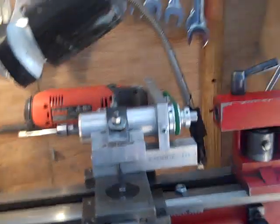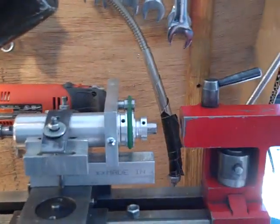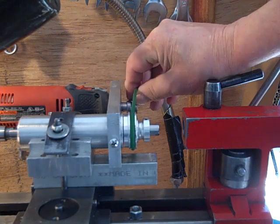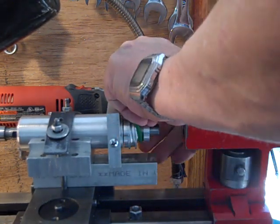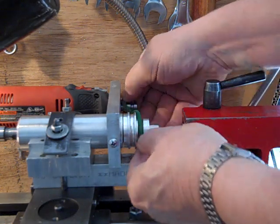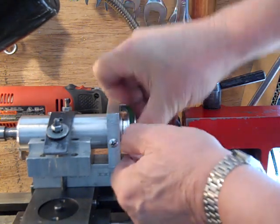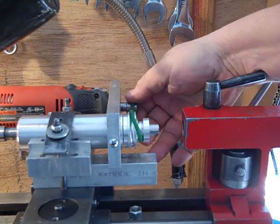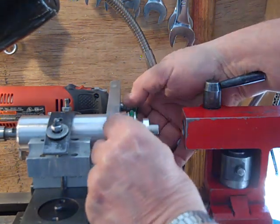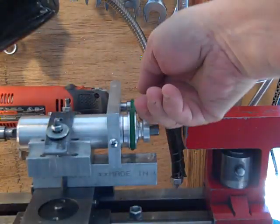As a matter of fact, I'm going to do that right now. If you change the belt — I'm sure most of you people know this — but if you twist it like this, it changes the direction of the rotation. And it's better to have it rotating this direction because these two guys are spinning in opposite directions. I could change that too, but this is easier.